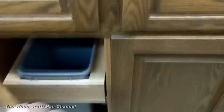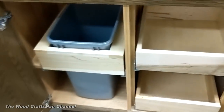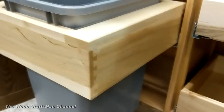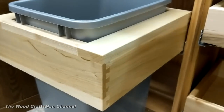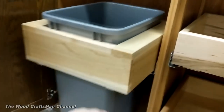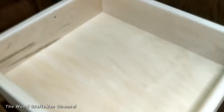There are pullout drawers, trays, or a column. This is a shop-built pullout — it's actually a dovetail drawer box with a frame glued to the top of it, and the opening fits the garbage can. It's a soft close pullout.